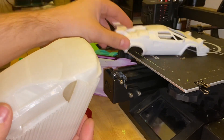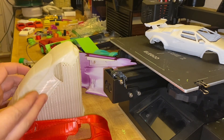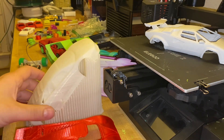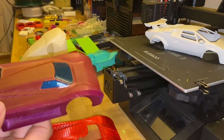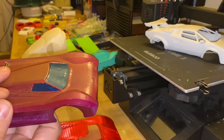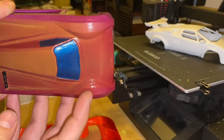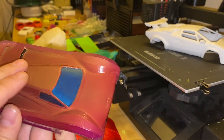So this is a way to improve resolution without changing layer height. It's probably better to do it diagonally at 0.2mm than horizontally at 0.1mm. And then when you come to these guys — yes, this is painted, but I didn't sand it — and you can still see the layer lines here a little bit, but you get much smoother curves all around.